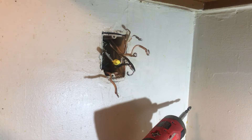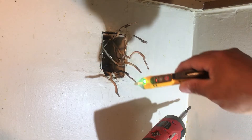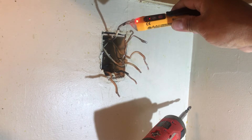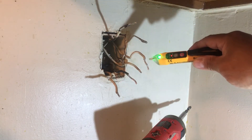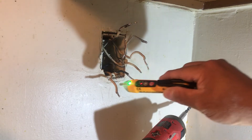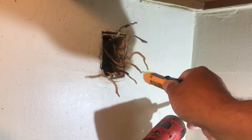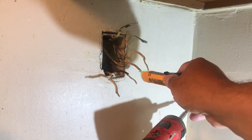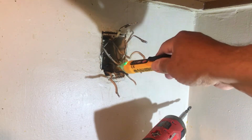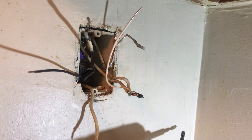Let me get the pigtails together so you can get an idea and then I'll show you. That's a load, that's a load, that's my line, that's my power coming in. Since I have two on each side and I have three of these, I'll take the shortest one — probably this one — make a pigtail, put these two together. That'll be one neutral and this will be a second neutral; this would be one hot load and this will be my line coming in, and of course my ground. Okay, we did our pigtail on the hot over here.